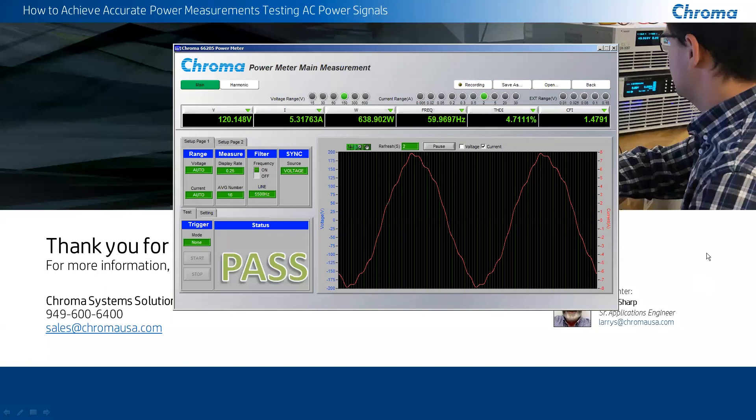Here I've got a small unit running, and you can see the voltage and the current. I've injected harmonic distortion using our AC source for this one — so the voltage is actually distorted, and then the current is actually fed through a resistive load, so the current and voltage are not phase shifted at all. We wanted to demonstrate the capability of our AC sources to this customer, doing various types of voltage and current distortion to show what we're capable of doing.